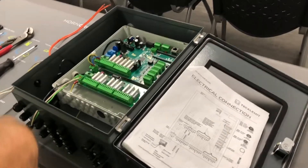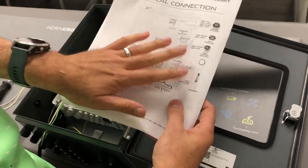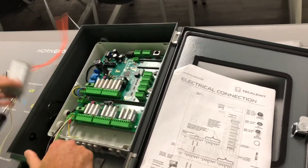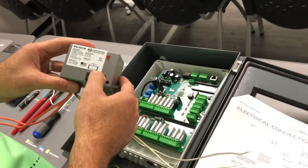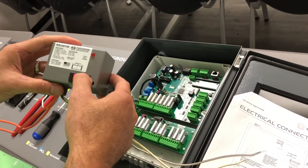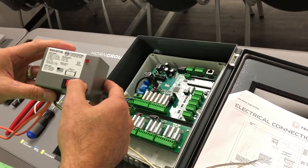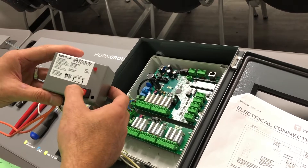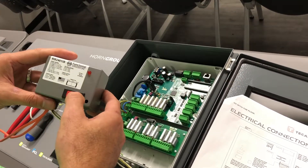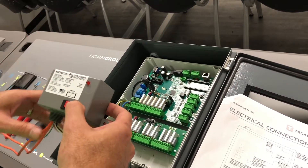Make sure you're following along on this page of the actual manual — this comes in the box. Contactor relays: let's get something out of the way first. To the right is your standard position — this is how you're going to leave it, all the way pushed to the right, which is your Auto. If it needs to be put in bypass mode, push it all the way to the left where it says Closed. Auto is where you need to have it — the box will do the rest.